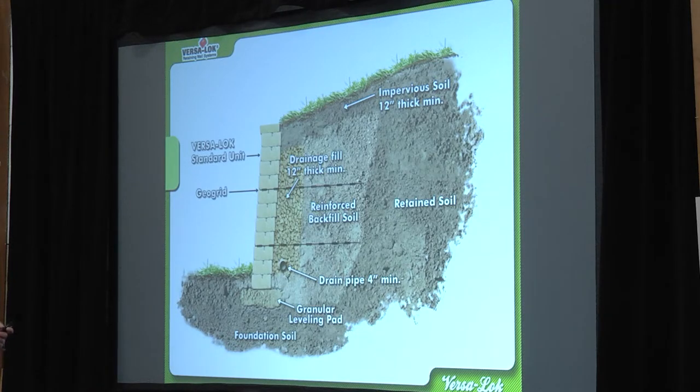We've got our grid, our drain tile, and a six-inch compacted gravel base. I've seen guys pour light PSI concrete. I'm a huge advocate of using open graded base for retaining walls — it's a little trickier to get the blocks perfectly level, but if you screed your material and use the same technology as permeable pavers, screeding off a three-eighths inch trap chip on top of your three-quarter clear base gives you a nice smooth surface.